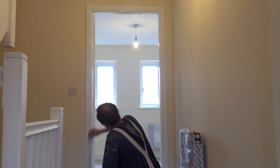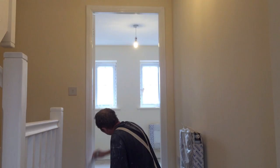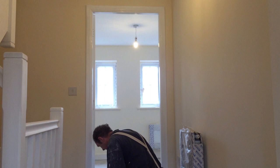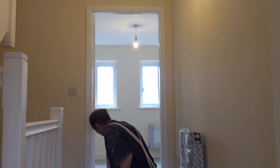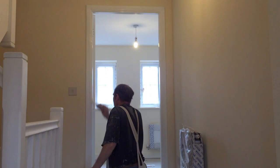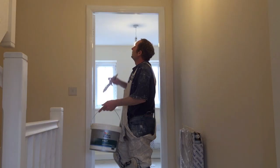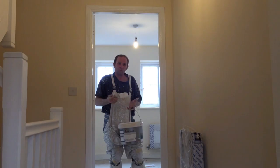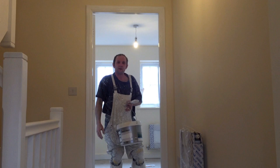Quite solid as it's dry. I mean, it's starting to dry already, but it's starting to look quite solid already just for one coat. Right, that's it, undercoated. So what I'm going to do now is leave that to dry, okay? Come back and denib the whole frame, ready for the satin finish, okay? So we'll get back to that as soon as that's dry.